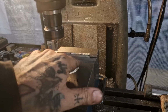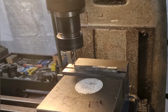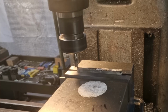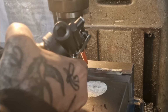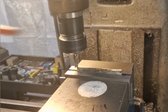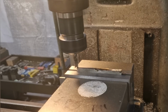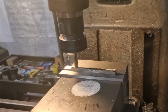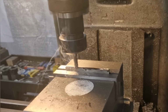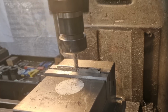I know, so we've just cut a strip of stainless that's in there from a bit of bar, because, sorry, a bit of flat, because I've got nothing the right size, so it's just touching off. I'm going to mill it square. It needs to be nice, doesn't it? So we just touch off at that. And steadily, once I've undone the carriage, steadily work our way along, look. Just to clean it up. We'll do the same with the ends. We'll turn it sideways when we've finished and do the ends. There we go, look.